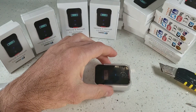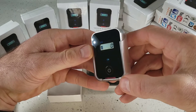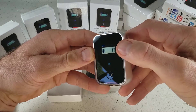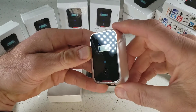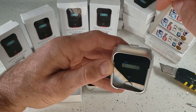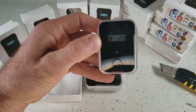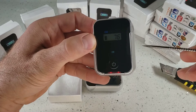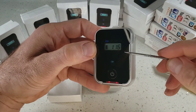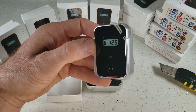So let's go forward. This unit has already been calibrated and been on for at least three minutes. And as you can see, when it's on, you get an instantaneous carbon monoxide reading — which now is zero — and your battery level. What we'll do now is expose the detector very quickly to some carbon monoxide. You can see how sensitive that is — that's a high amount of carbon monoxide, and you're going to start seeing it trigger simply because it's exceeded 50 parts per million. As soon as it does that, immediately you get the alarm flashing and the buzzer buzzing.